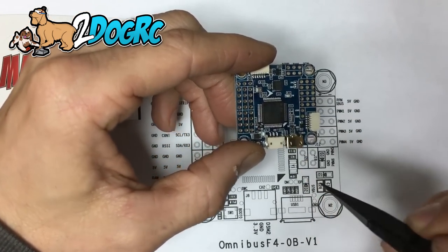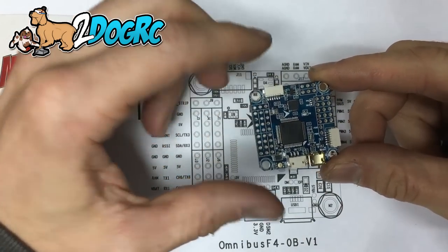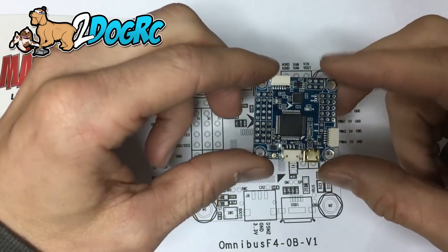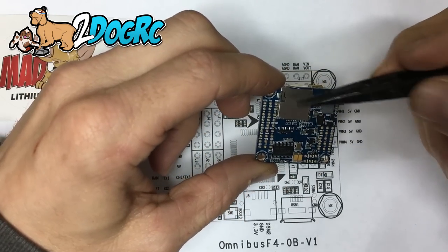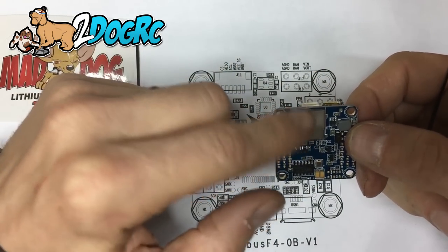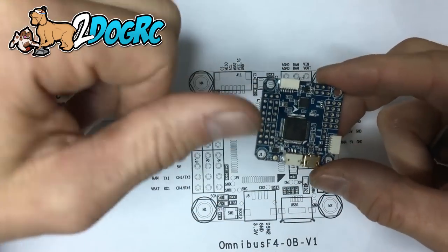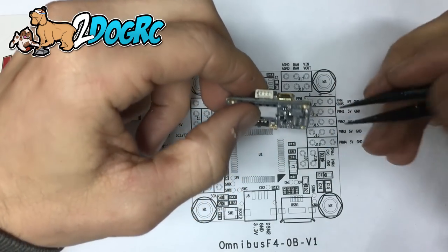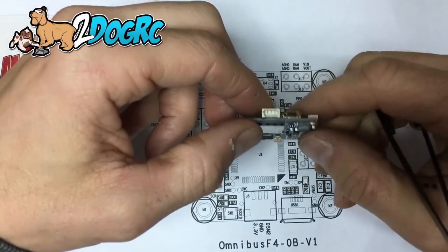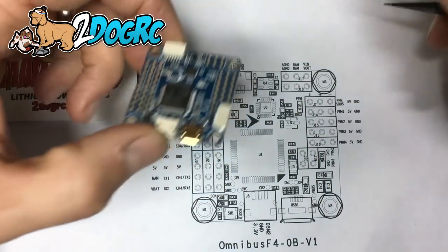This is your arrow for which way is forward, so however you mount the board, make sure you remember and check that in your GUI before you go fly. On the back here is also your SD card slot, so you can log stuff. I really recommend putting a Class 10 SD card in there and leaving it in. You never know — if you have a crash, you can pull out that data off the black box and go, 'Motor number 4 is bad,' fix it, instead of trying to post a bunch of questions on the internet when all you really need to do is look at your black box log.